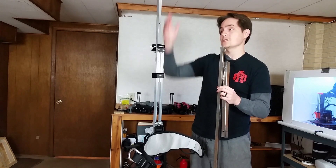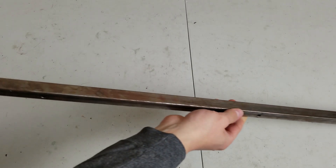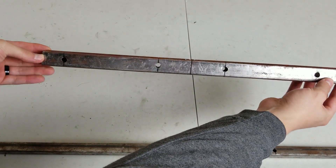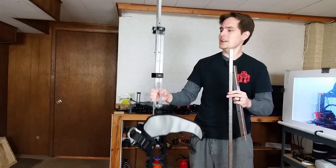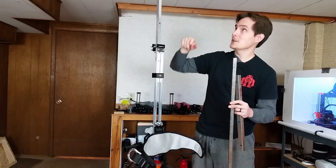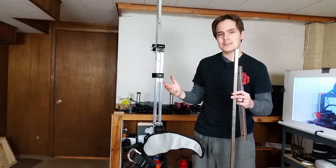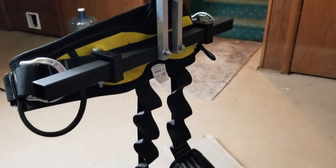In the last video I put this all together but I quickly saw an issue. I used steel tubes for a lot of this and they started to rust and corrode. So for the tubes that had sliding components I replaced them with aluminum — these two and these three pipes here — and they shouldn't corrode now. For the pipes that don't have any sliding parts, like this one down here or the ones up here, I just painted them.